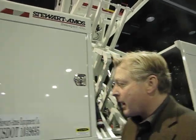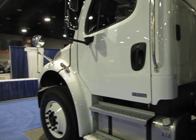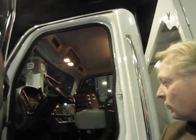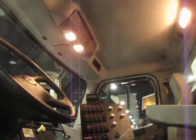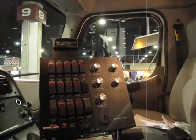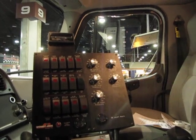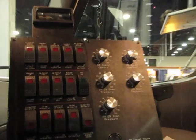The one we're displaying today is a single engine version mounted on a Freightliner M2 106 chassis that has 240 horsepower. One of the nice highlights is the control panel — it's very easy to use and very intuitive for the operator. This model features the optional gutter broom down pressure from in the cab and speed control on the gutter broom and main brooms.